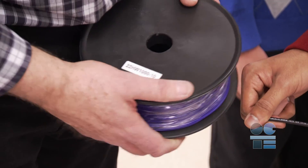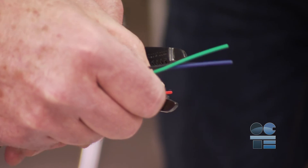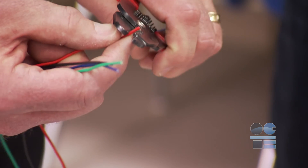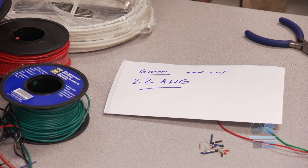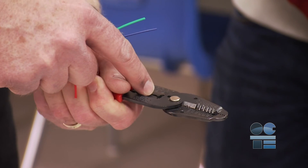Here is some 22 gauge wire. Look at the wire stripper to use the 22 gauge slot on the wire stripping jaws. Measure or estimate the wire to be about 6 millimeters past the wire stripping jaws. You need about that amount because that is how much of the plastic sleeve has to be removed from the wire so the pin will crimp properly to the wire. Make sure your fingers and hands are clear of the cutting blade and pinching point of the wire stripper.